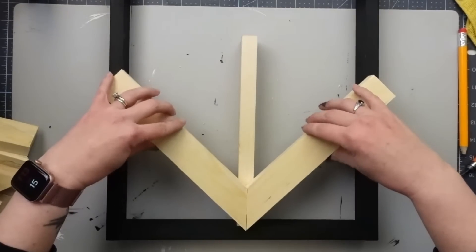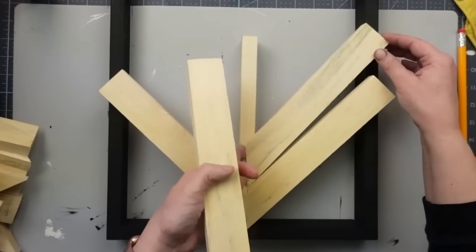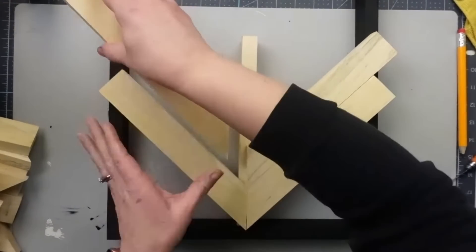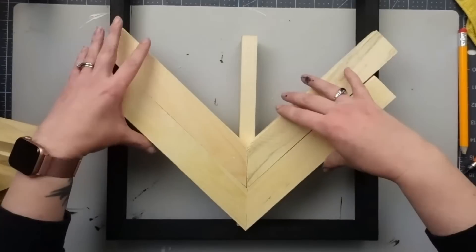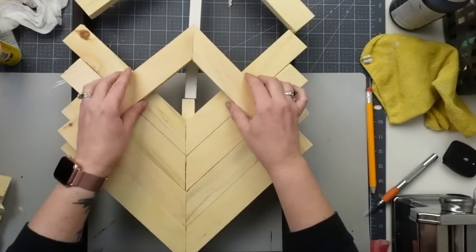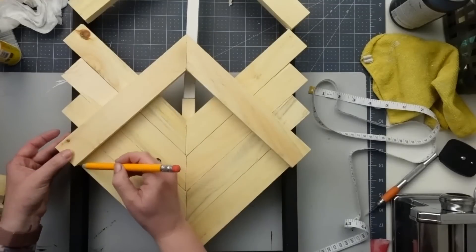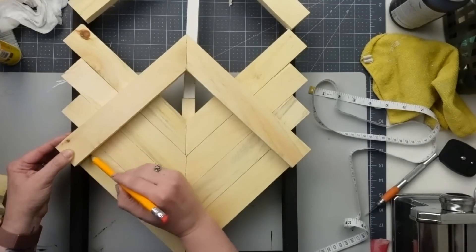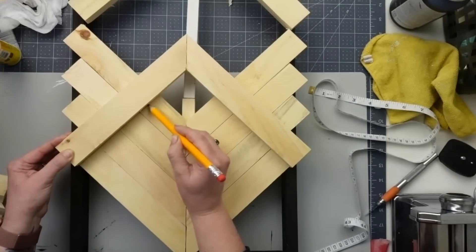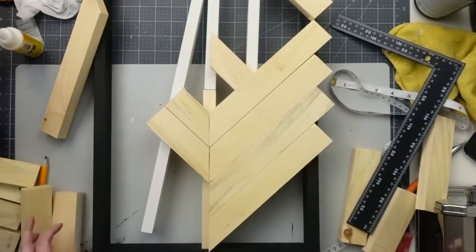To build the pattern, I started laying out the wood pieces with the 45-degree angles together forming a point, and lined up four sets one in front of the other. I laid a scrap piece down in the middle so my wood didn't fall while laying out the pattern. With four sets laid out facing down, I did the same thing facing up, with the bottoms overlapping — that's where I made another straight cut. Once happy with the spacing, I drew a line and cut those pieces down.